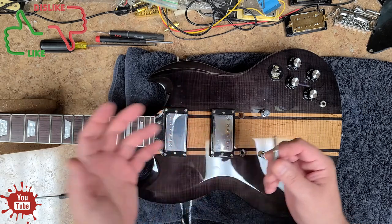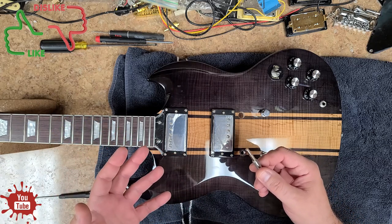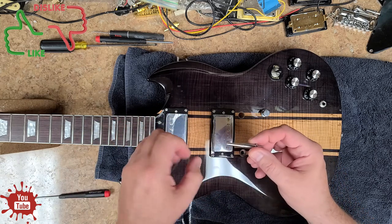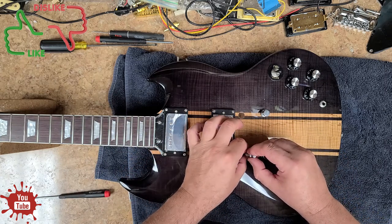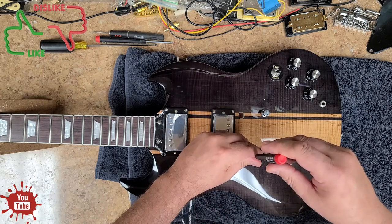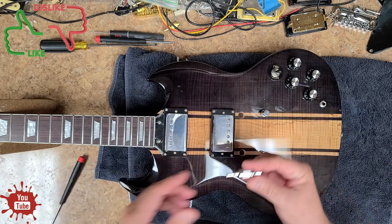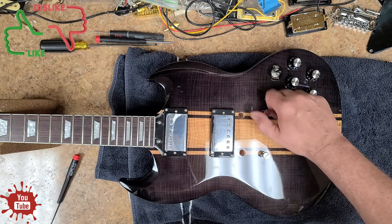I ended up pulling them out because we ended up throwing, we had a shitload of these screwdrivers from other companies that were advertisements for their product or their company or whatever. And I ended up plucking the magnets off of the back of them. Basically, all they are is these little sticks that are surrounded in plastic. Take a pair of pliers and kind of twist it a little bit, and they pull right out. So I saved them, and this works perfect for pulling out sleeves. Stick it in the hole, thread it, start turning it, and you'll see that sleeve slide right up, just like that. Now I do not see, there wouldn't be a wire on this side, that's for sure, it'll be on the other side.